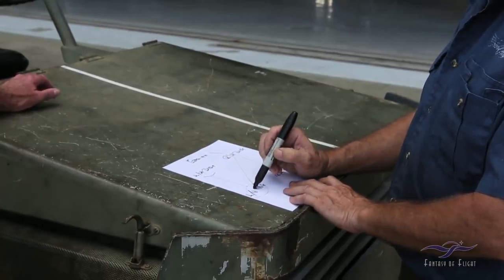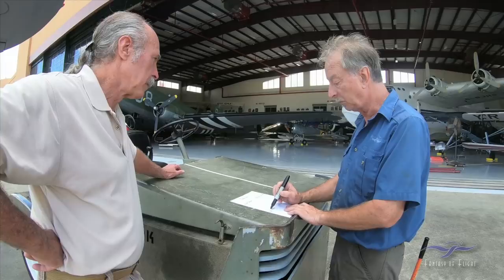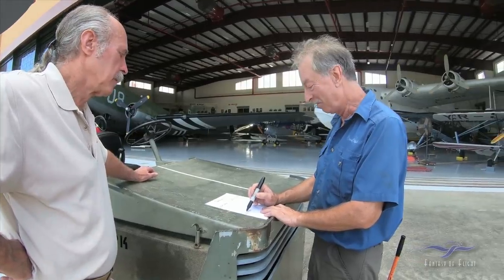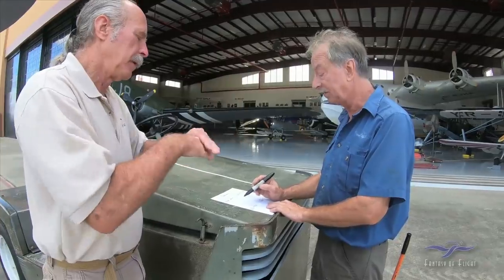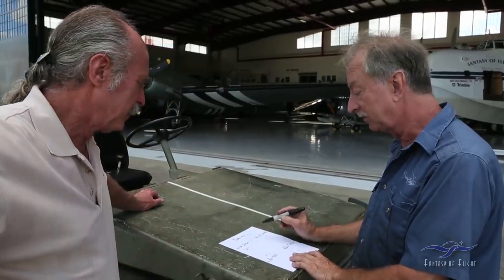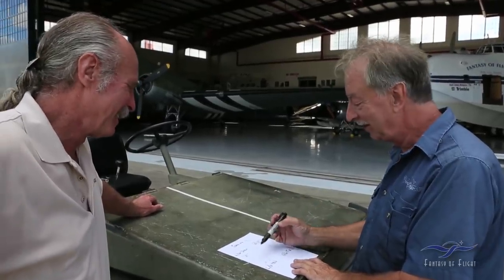It's possible that the magneto itself has developed a problem, and I believe that Wayne has just been through and checked the points and pulled the dollar bill through, the traditional, old-fashioned mechanics method. Basically, clean the contact breaker points. You don't need to use a ten, a dollar works just fine. Don't waste your money on that. Points file, complete waste of time, don't do that at all. That dollar bill's the way to go.